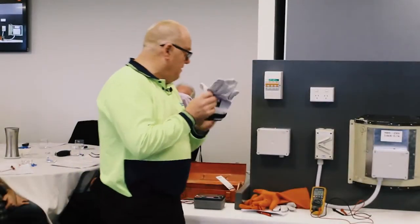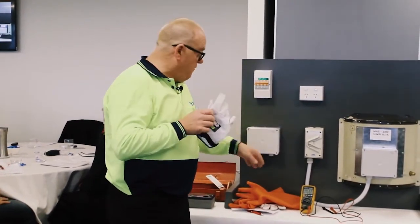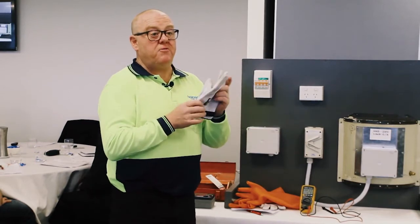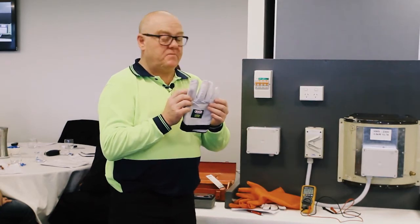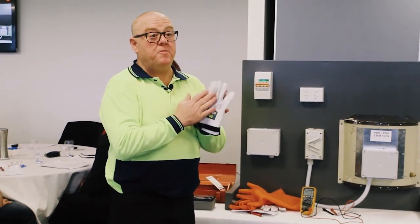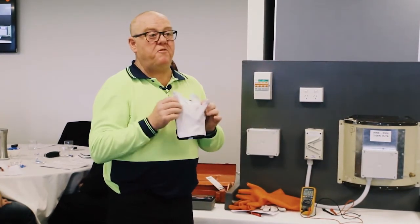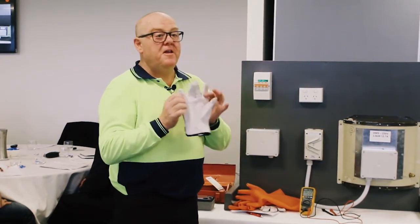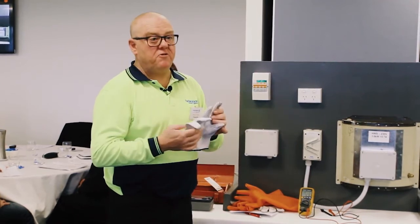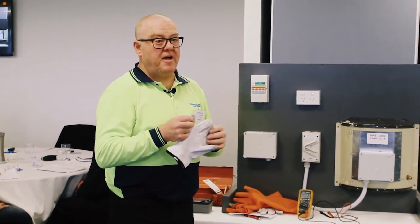These are, dealing with the manufacturers, purpose-built leather outers for electrical work. Now, the specs are on the bag. They're not a rigger's glove. I'm getting our students to use the purpose-built ones. I'd imagine we'd all have to go down that same path. All these are there for us to provide mechanical protection for the insulated gloves. There's my insulation protection. This is just to make sure that while I'm using the screwdriver or whatever other tools, I'm not going to wreck my insulation layer.